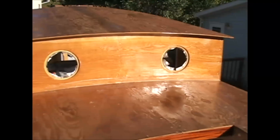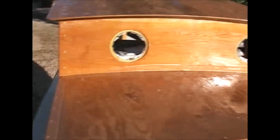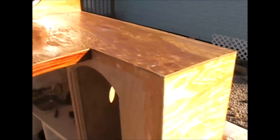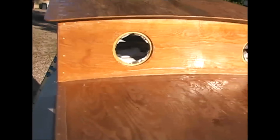On the first day of glassing, I've got the back of the pilot house and the reinforcing piece at the seam. I've got 4-inch tape on these edges, and I've got the back of the cabin glassed because they overlap the top and the sides. The side pieces are going to overlap both of those, so there's extra glass in all the corners and that also overlaps around the side. There's double thickness on all of the seams.